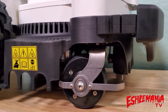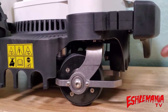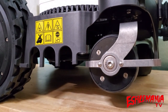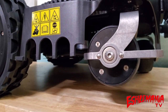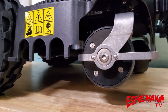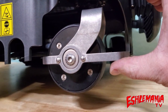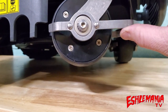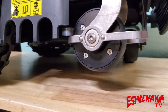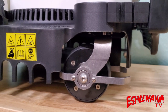I showed you that this thing will articulate to cover the contours of your ground better. Here's an example: we've got the back wheels sitting on the ground and this thing will raise up that high, and you still have both back tires on the ground and your other tire on the ground too. This one here can move up and down that far — that's a good bit of travel, letting this thing move around to cover those contours and give you a nice even mowing job.